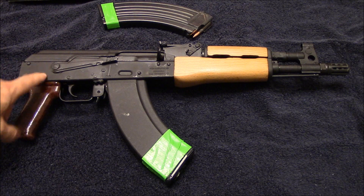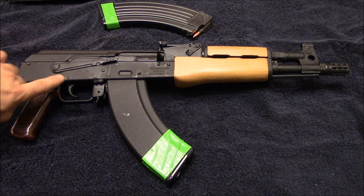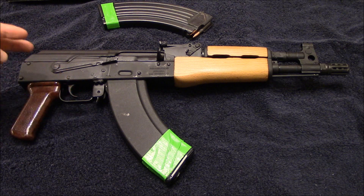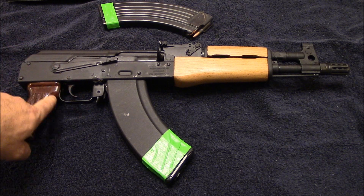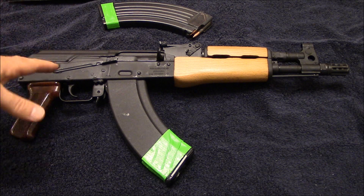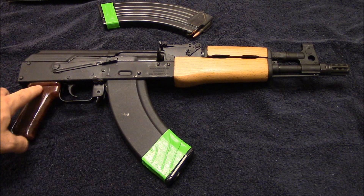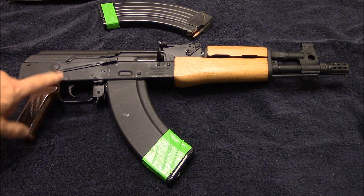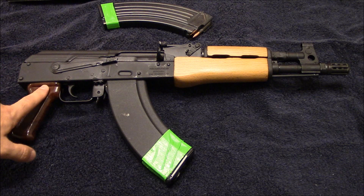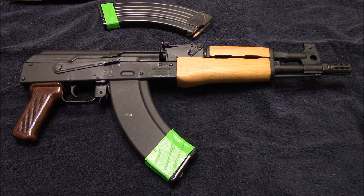My plan is to get an adapter bracket from US Machine Gun. Your receiver slides and pops into it back here, you take off your grip, and it has a whole cutout — unlike the two open-bladed end of the SB47 brace. The US Machine Gun Draco adapter has a cutout for the T-nut for the AK pistol grip to go through, so you reinstall the pistol grip and it locks in much more securely. That's another issue with the SB47 brace: they all come loose, start to twist and slide. With this bracket, a tight square-shaped hole for the T-nut and some Loctite keeps it solid.